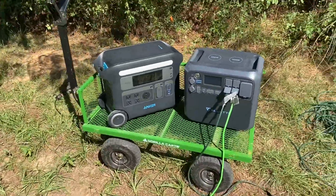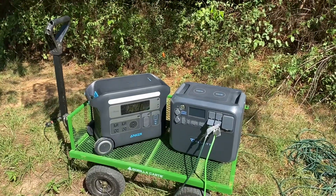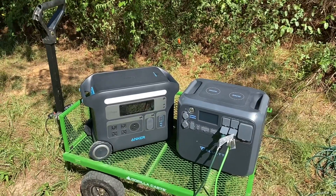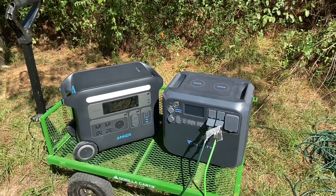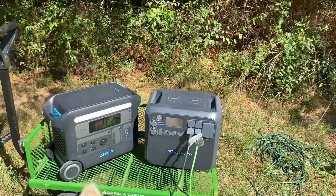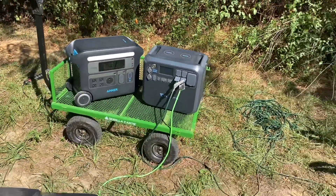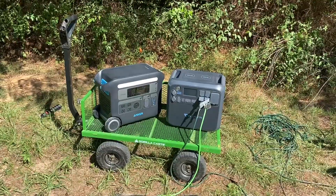So I'm going to give the Anker a thumbs down and the Bluetti a thumbs down. Surprisingly, the one with the least amps ran them with no problems — and that was the Dewalt power station. Of course, Dewalt's got its own little issues. Both the Anker and Bluetti are rated at 20 amps. I was trying to pull 30 amps from them — 15 each — so it shouldn't have done it and they didn't. The Bluetti just shut one device down, while the Anker shut down completely. The Dewalt just kept going, obviously doing a lot more than the 15 amps it's rated at.